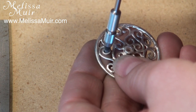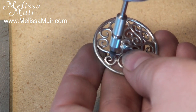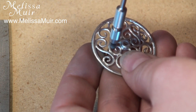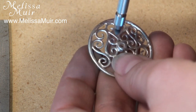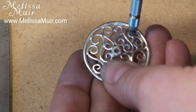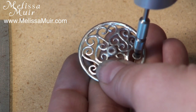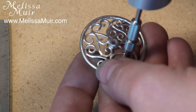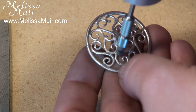The polishing pins are a fantastic addition to your existing polishing methods, whether you have a bench polisher or are using felt wheels on your flex shaft. You're going to have a difficult time getting into some of the tighter spots with wheels alone, and these pins allow you to get into those areas. Just like the wheels, I'm going to work my way through the grits all the way down to the fawn, where I'm left with more of a mirror finish.